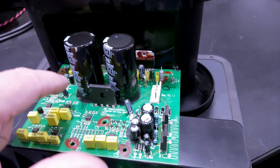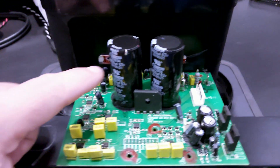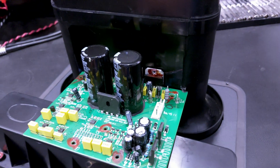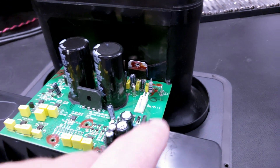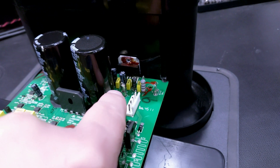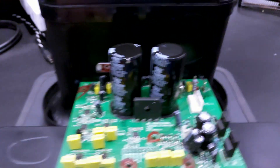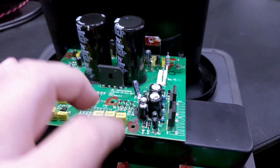There are five plastite-type screws holding the board in, and you also have to take out the two screws for the chips. You will need thermal grease because mine was pretty crusty. Be very mindful of this particular chip — there's a power fuse linked right to a capacitor nearby, and if you use a standard screwdriver you'll get sparks — ask me how I know. Use an insulated screwdriver or wrap electrical tape around it, or just discharge the capacitors first.